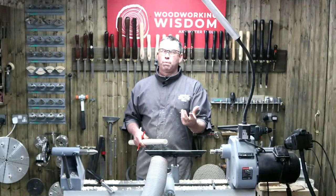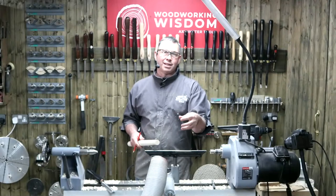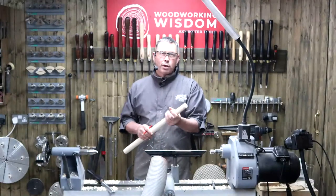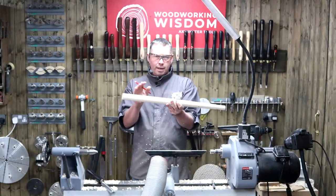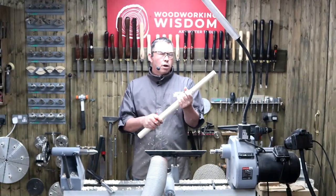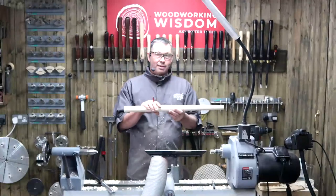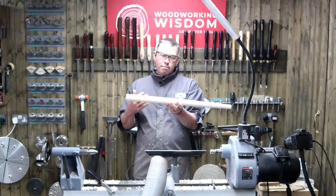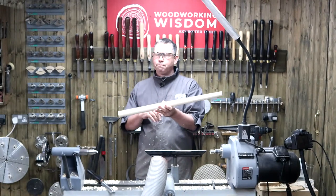If you want to put a hard-wearing, like, yacht varnish on them, absolutely, just try and seal the timber. But if you do that, you've got to do it before you stick it together, so all over to create a complete seal. But sometimes they're left out in the rain. I think that one may have been left out in the rain a little bit too long. But if it's the right timber, just left as it is, it's fine.